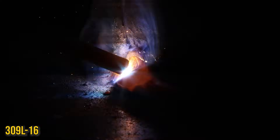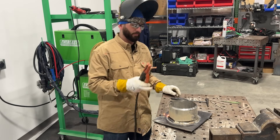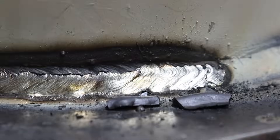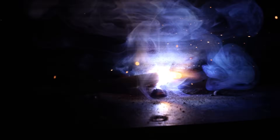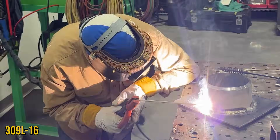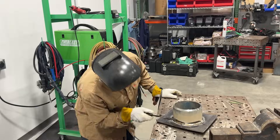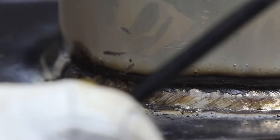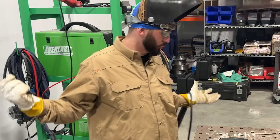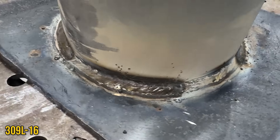Regardless of whether that slag is wet or kind of sticking, it's still a really heavy slag rod and it makes it tough to see the weld you're putting in, especially if you're getting a pinhole behind you. Looks like we're getting pinholes mostly at the beginning of our weld — which tells me that after the rod's been running a little bit, heat has been put into it, baking out something bad, and then no more pinholes later. Starting farther ahead to get the rod warm helped. I'm just going to do the normal welder thing and blame the rods. We got this one welded up to show the differences between those fluxes in the flat or 2F position.